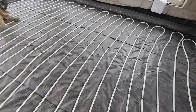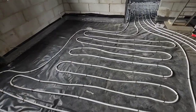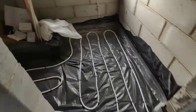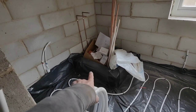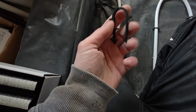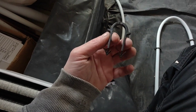The plumber's been in and put the underfloor heating down. That runs through all rooms - kitchen going in there and through here. The bathroom tray is going to be put in later because we don't know where the waste is going to come out. All the clips are down - you can get a gun for it, you just stab it into the ground and they're just plastic little clips that shove through your visqueen into your Kingspan.